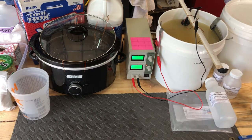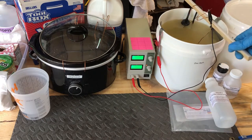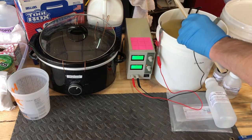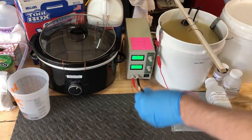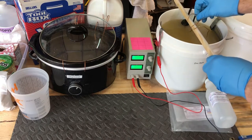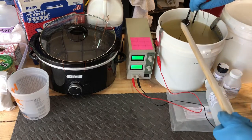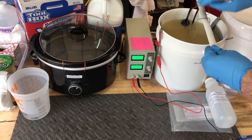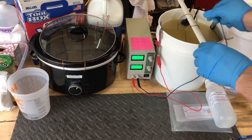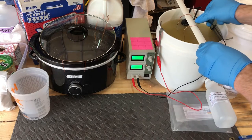I have a sticky note with nine square inches on it so I can estimate. I'm going to call this piece about seven square inches of surface area counting both sides and the tabs. Seven times 0.14 is about one amp. So I just turn this dial up - there we go, 1.03 amps. Now I'm going to let that sit for 15 minutes. After about seven minutes I'll take this out and turn it around to make sure the plating is even, then reconnect it and let it finish.